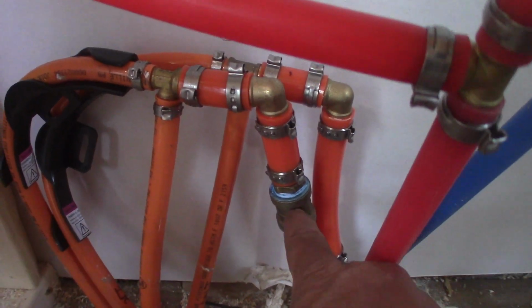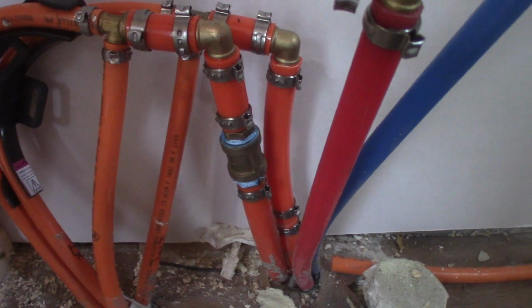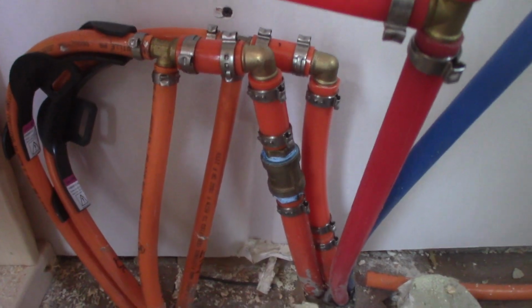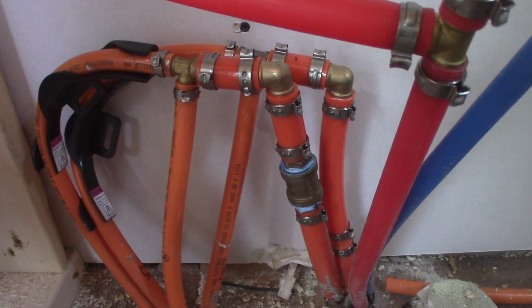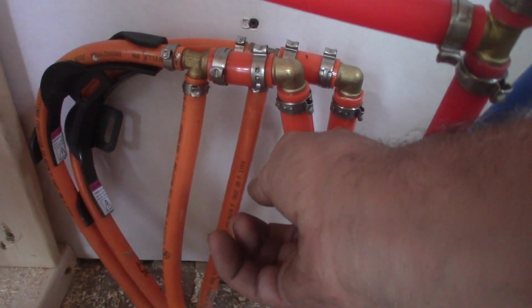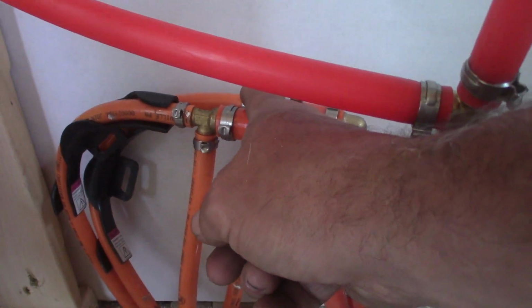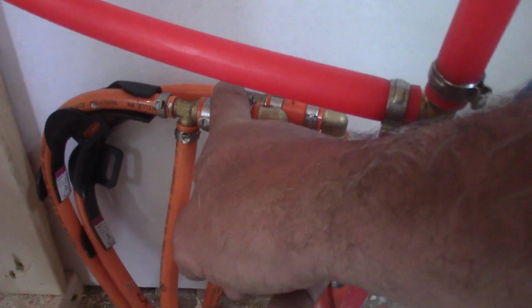And I got my heat system set up. Now it's just very simple in here. And I just use fittings I happen to have. That's why I did that. Not trying to make it complicated, just trying to use up stuff. Because you know what, I got too darn many fittings, and I'm always buying fittings, so I gotta use them where I can. Anyway, what I did is I have an incoming line here. This will be the flow coming in, pushing hot water, which will be tempered down from boiler temperature, so it'll be like 100 degrees or so, something like that, 96, maybe 105, I don't know yet.